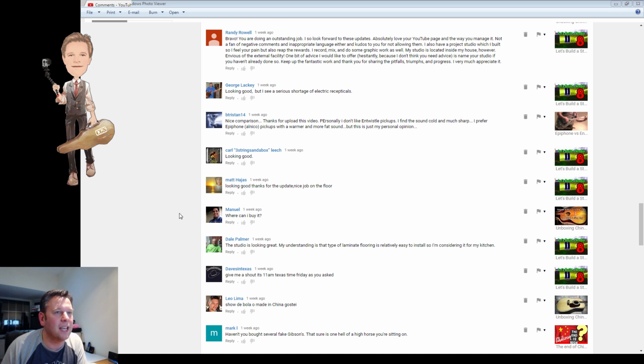Manuel, where can I buy it? KE24. You can buy it on AliExpress, but again, I'm not recommending it. Do your homework. Dale, hey Dale, another regular. Studio's looking great. My understanding is that type of laminate flooring is relatively easy to install, so I'm considering it for my kitchen. It is, but it's not always suitable for kitchens or bathrooms because it does puff up if it gets wet in the joints. So check with your supplier that it's actually suitable for kitchen and bathroom. As it happens, the one I laid is, but it's a slightly more expensive version. You can get very reasonably priced ones in the UK, and some of them are not suitable for wet floors at all.